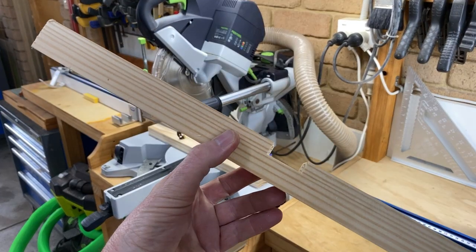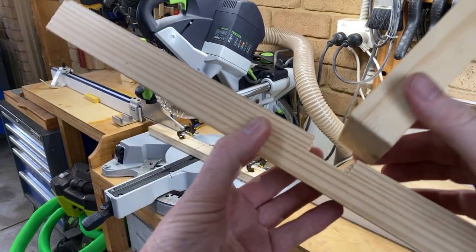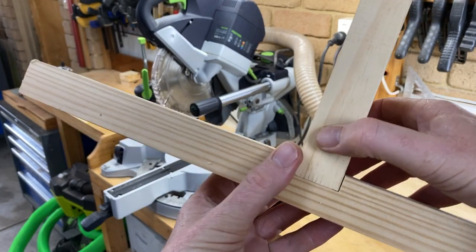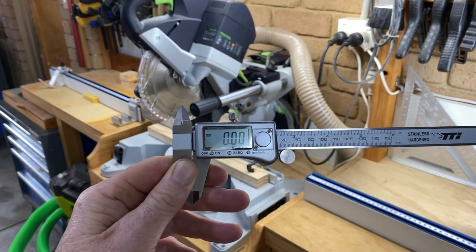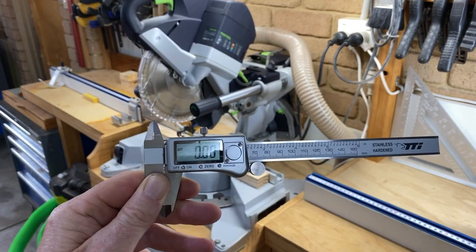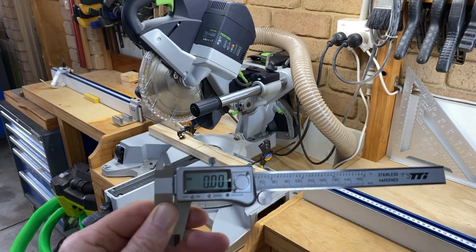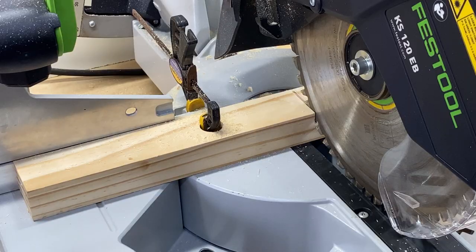You can see how easy that was. No fault of the saw — just me getting used to the kerf maker, which is ever so slightly loose, so I'm going to have to fine tune it to get a tighter fit. What I'll do differently this time is set the kerf maker to the kerf of the blade using a set of calipers instead of pushing up against the block of wood, and we'll see if we can take out a bit of the slop that way.